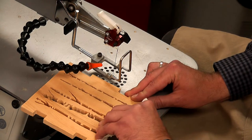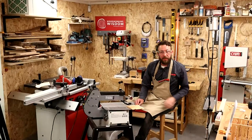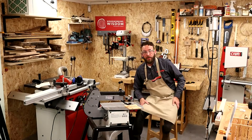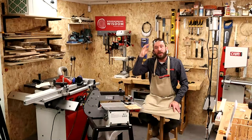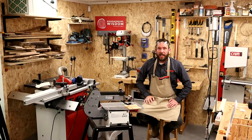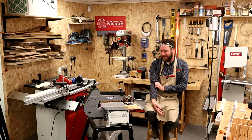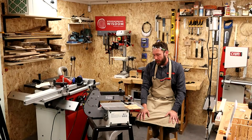I would go with either a handsaw or the bandsaw. Not really designed to cut straight lines, these scroll saws. But if you wanted to cut a straight line, check out the hook tooth ones. They're pretty good. Perfect circle, it's practice, really. I mean, a perfect circle is something that artists and stuff have been trying to attain for years. So it is a tricky little thing.